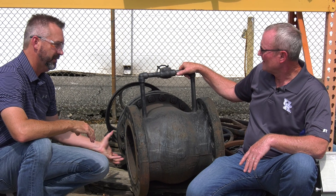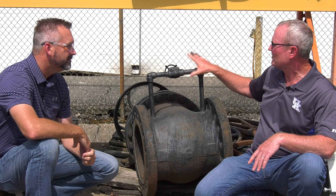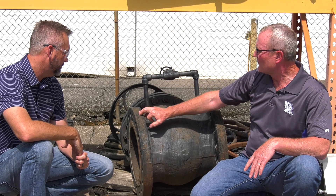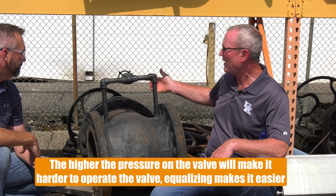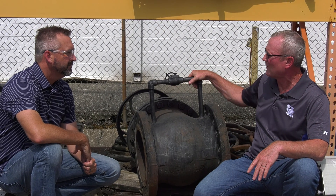There's obviously a lot of pressure coming here. That's the secondary use for it. Most technicians in the field are not as concerned about warming the line up as they are about opening that valve up. If you've got a 300-pound or 600-pound system, that's a lot of pressure on that gate — makes it real hard to open that valve up. If you equalize it, get the same pressure on both sides, it makes it really easy to open up. Then you don't have to worry about cracking that valve and going real slow to avoid too much steam getting in and the pipes shaking. It's all heated up, equalized — makes it real simple, very safe operation with an equalized line.